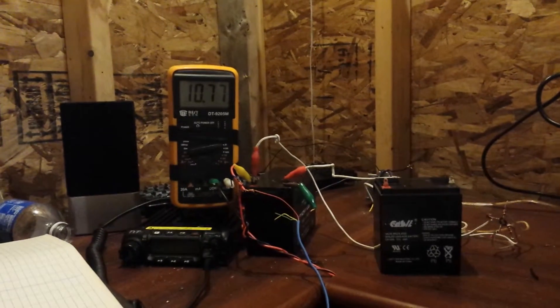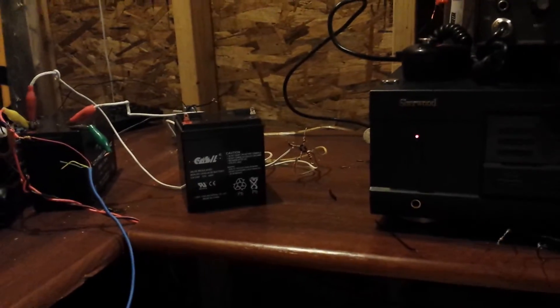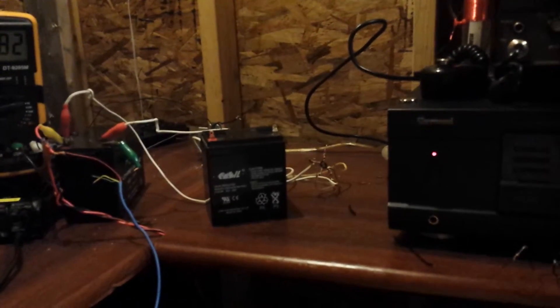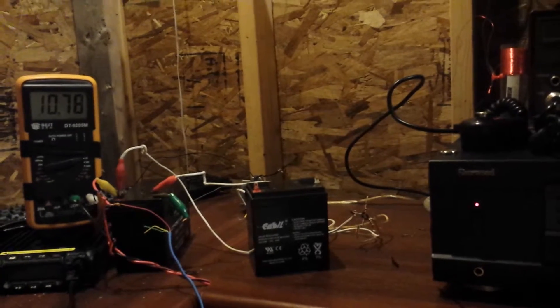As you can see here, if you don't use a full wave rectifier and you do batteries in series with lights, your battery charger probably won't work because it needs alternating current. And what I mean by that is if you connect it, you're just putting DC through the coil. It wouldn't make any sense — you need alternating current for that to turn to DC for your batteries.